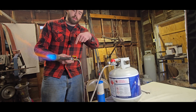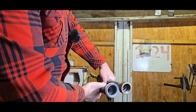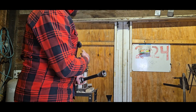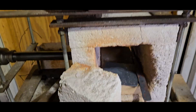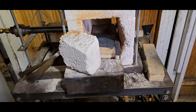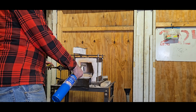This burner should be a lot better now. We just had a little clog from the soldering. You can see the old one is oxidized and the heat warped it — the new one uses the exact same part. This part that's been used for almost a year has expanded, so this end is a consumable. You may need a new 8-inch nipple and reducer. Light the torch and check it's working. The burner is sitting on my bolt-together forge stand — I've got a video on that. I'm just using some metal wire to hold it in place.